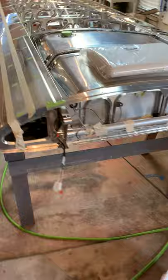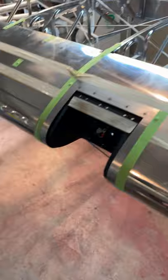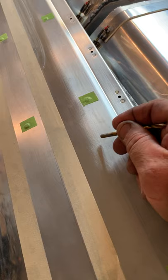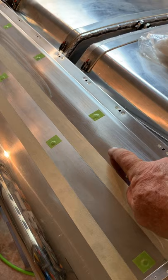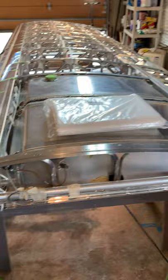The fine-tip compressor blower is so much more powerful - I blow every inch and cranny. You do not want one piece of metal shaving in here, because even a tiny piece of metal shaving that gets between the fabric and the metal will come all the way through the paint and stick out. The only way to fix it is to cut it out and practically patch the fabric - that fabric is so tough. Really go over it several times. I'll come back for the next stage, probably when we get to the aileron false spar, which is a tricky spot.